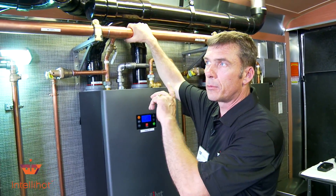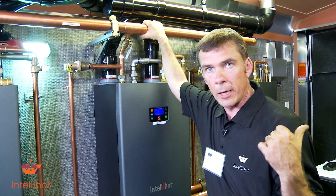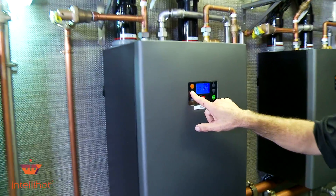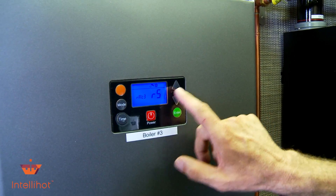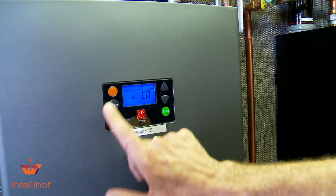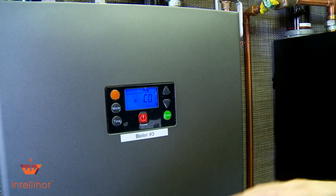We're going to have to be able to turn a fixture on — something that draws enough water to get enough gallons per minute per the I.O. manual. We have that now. We want to go into the mode so we can set it up. I'm going to hold this button for five seconds. You can see it's jumping in here — I'm going to hit the button until I get to high CO. See it right there? This thing's going to get itself started.